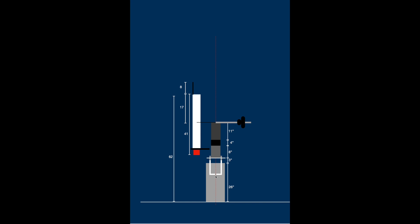The next consideration was how high do we actually want to make the concrete pier. I decided I would like to access the saddle plate at about shoulder height — no higher than that — so I don't need a step stool to reach a higher saddle plate mount position. This allows me to swap out between my SVX-130T refractor and the C11 reflector without having to climb a ladder. This gives me pier diameter, J-hook spacing — I put three inches in so I could get a wrench in when I need to level them — and a placement of the axis of rotation at about shoulder high. When I put all this together, it gives me an overall height to the top of the telescope of about 62 inches.